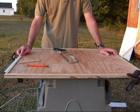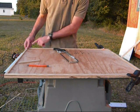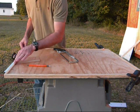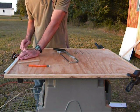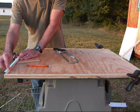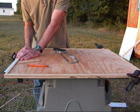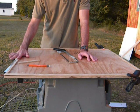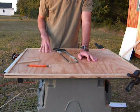What I'm going to do now is take my silicone sealant, lay a bead across all of them, lay them down flat, and clamp them down so they can dry. I might use a few screws and screw them down, or I'll probably end up using little brad nails — little tiny nails — putting a few on there so it really holds nice and tight. After that, I'm going to go ahead and stain the inside and stain these.